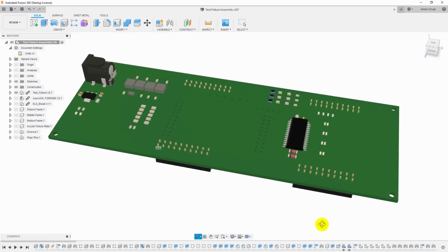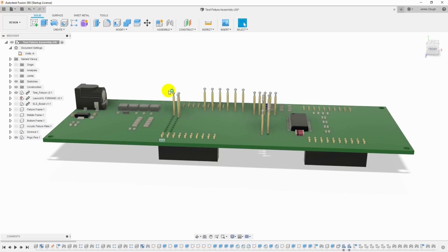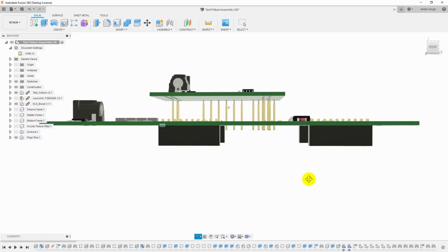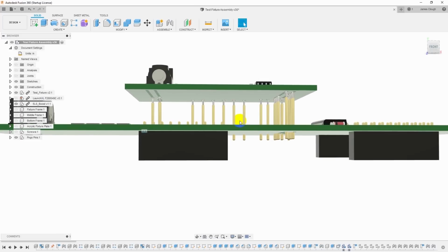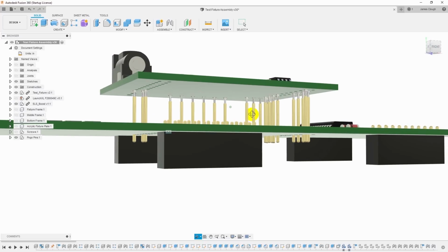This PC board is a test fixture for testing the interface boards for the electronic lead screw. Now, this is a PC board that I designed, and it will have pogo pins on it. These are spring-loaded contacts with contact points so that I can put the PC boards that I'm manufacturing directly onto those pins. So I don't have to solder connectors onto them. I can just drop them on those pins, and they'll make contact with all the required test points to test